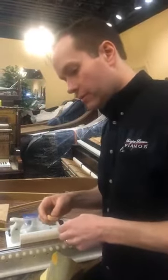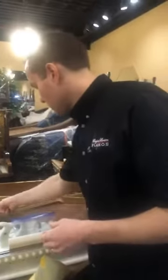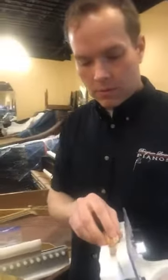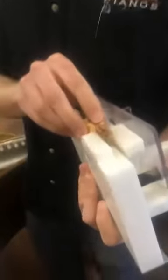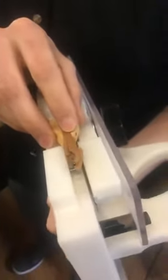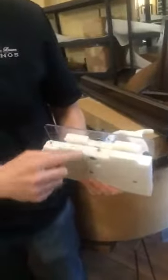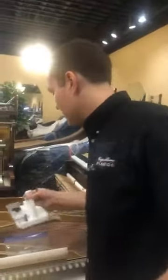And the final, no, second to last step. You get to use this on the bandsaw, which goes in there, and we'll run through to taper all of the hammers. This just slides on the bandsaw, and it does two hammers at once, one there, and these little set screws determine various things, from how extreme the taper is to where the taper begins, in conjunction with setting the table saw.